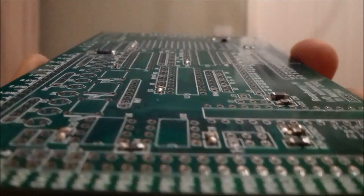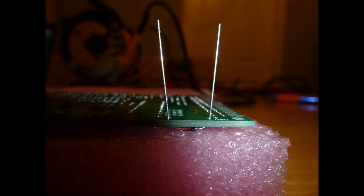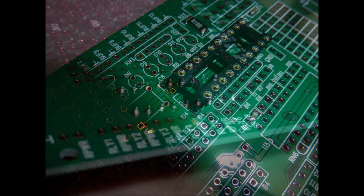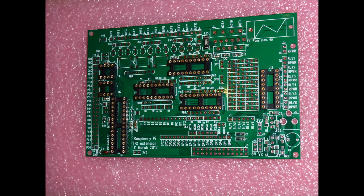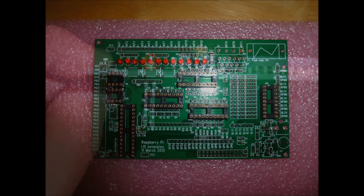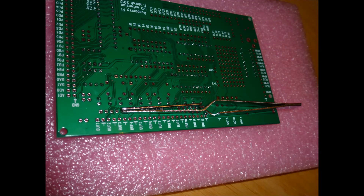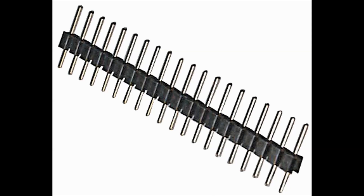It can be quite fiddly but it's definitely worth a go. Then once you've done that you need to put your through-hole components in. Start with the diode — push the legs through and solder them in place. Use the foam to hold them so they stay nice and flush to the board. Then move on to the chip holders and solder all of those in — nice little silver volcanoes are what you're after. Once they're done they should sit nicely on the board. Then line up your LEDs — solder in one pin at a time so you can make adjustments, and use reverse tweezers to hold them in place. Then you have to do what feels like a hundred pin headers; solder those all in and your board is pretty much ready to go.